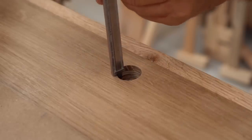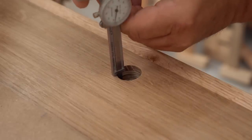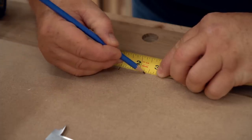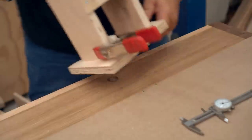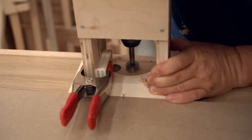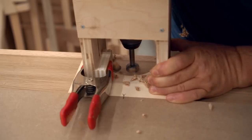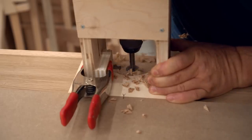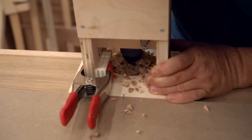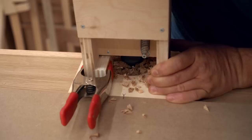Each dog location needs two holes — one for the dog and the other for the button — and those are spaced apart one and three-eighths of an inch. I'm going to mark that on the fence as well. I gave this a lot of thought before I started as to how many of these I'm going to need and I came up with a total of nine, so that's 18 holes that I have to drill. I go into a little bit more detail on why I chose these locations in the website article; there's a link in the description.